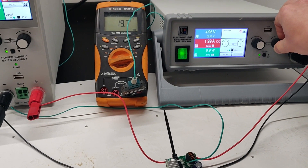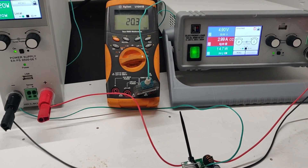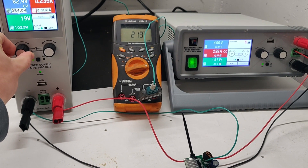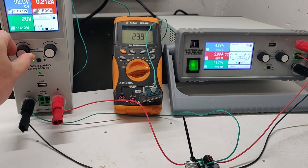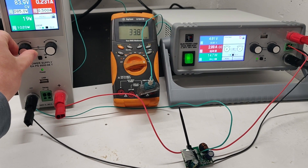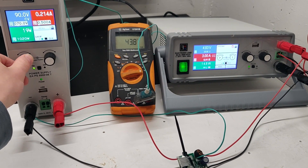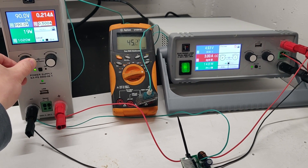Load set to 2A, then 3A — everything looks fine. Temperature is rising, that's normal. What I also wanted to do was change the input voltage a little bit faster to see if the output voltage stays stable. You can see I'm changing the input voltage quite fast at the top load of 3A, and the output voltage stays quite stable, which is nice.